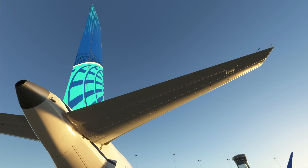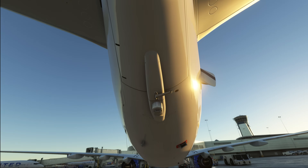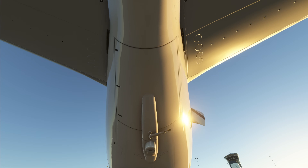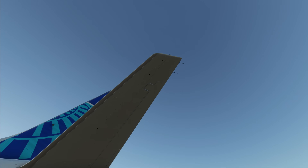As we move along the back of the aircraft, we make sure there is no damage to the APU outlet and check the position lights located at the tail to be illuminated. From here, we move forward and check the tailskid — making sure there are no scrape marks on the back, as these are the points that would make contact with the runway first if a tail strike were to occur. We also have a general look at the APU compartment to make sure no fluids are leaking.